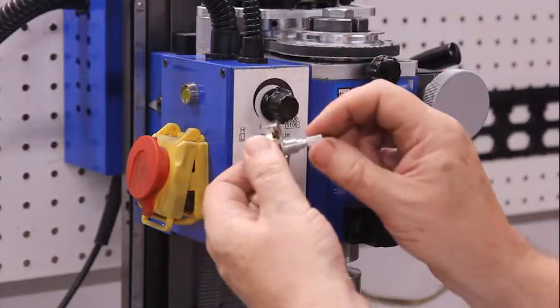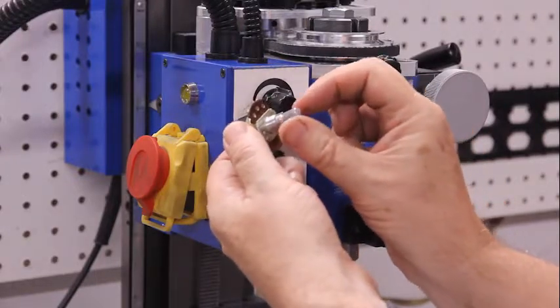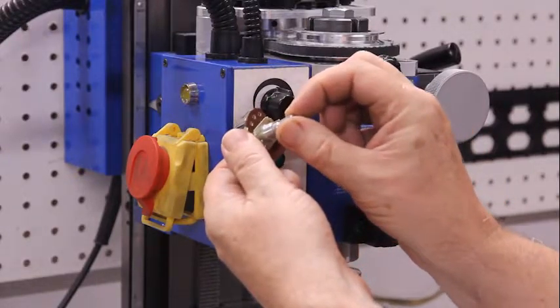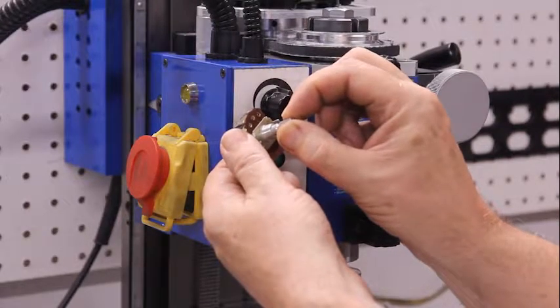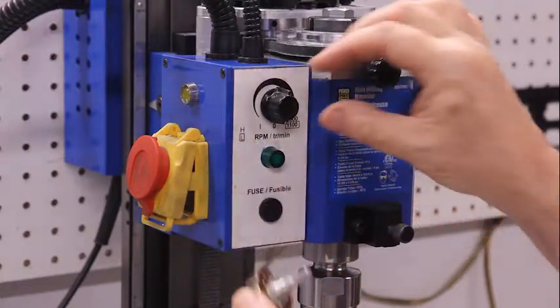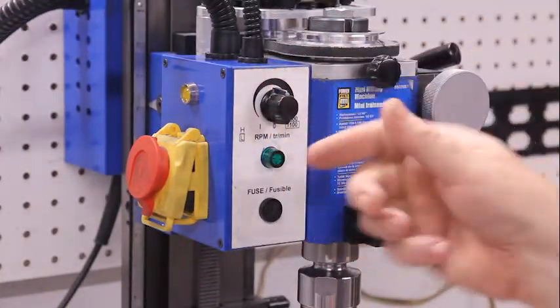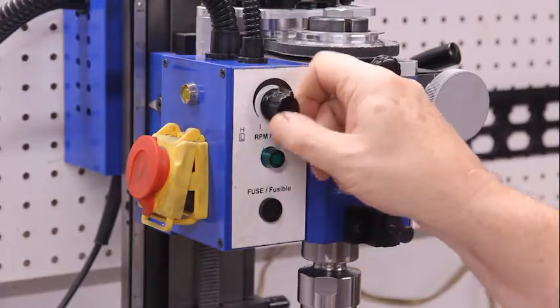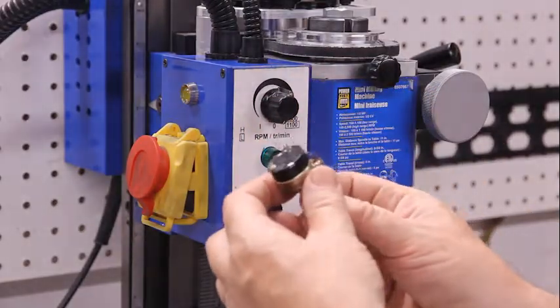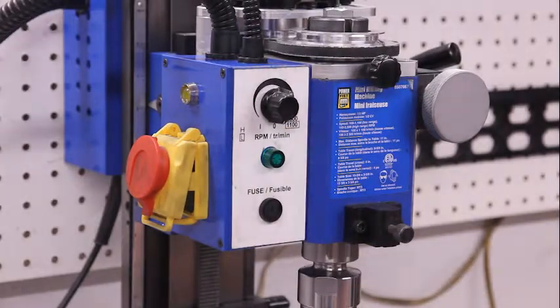The purpose of this is to ensure that when you turn it on, the speed control knob is in the off position. You don't want to have the speed control knob turned up high and then turn on the power and have it come on like that. So that's the purpose of having this type of knob, and I believe we can implement that using your controller.